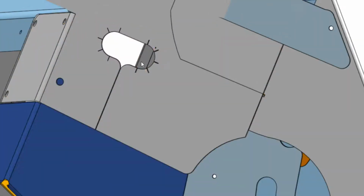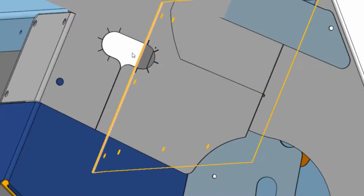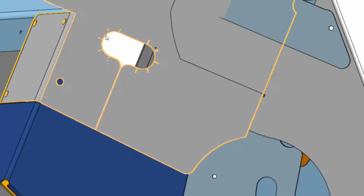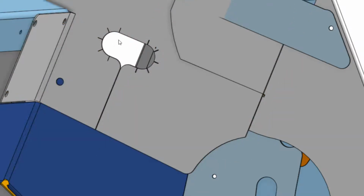So there's that one. Once you run that line through there and you get this all assembled, I would use some of the aluminum foil tape that's provided with your kit to button this hole up tight. I would put tape around it and over the top, wrap it around that oil line, stick it on, and it'll form, fit, and adhere as well.